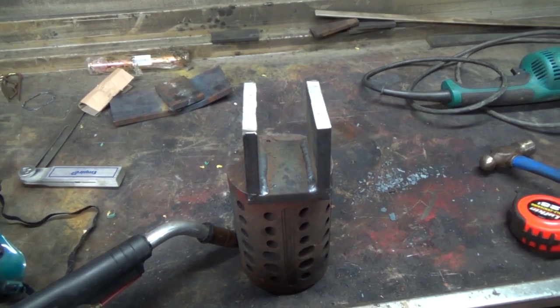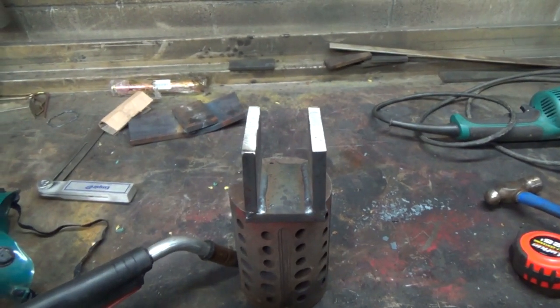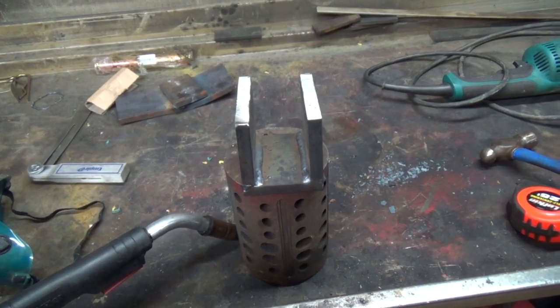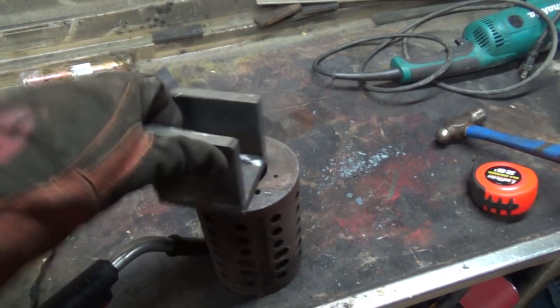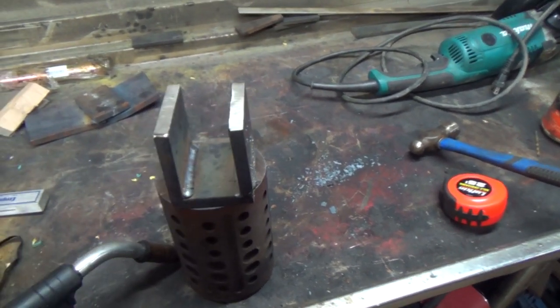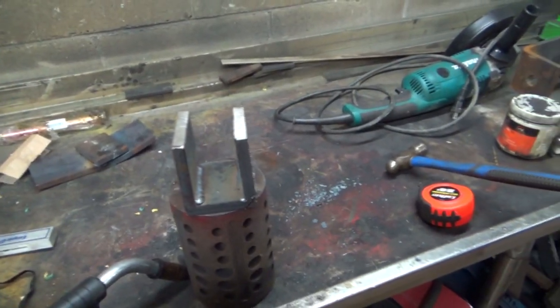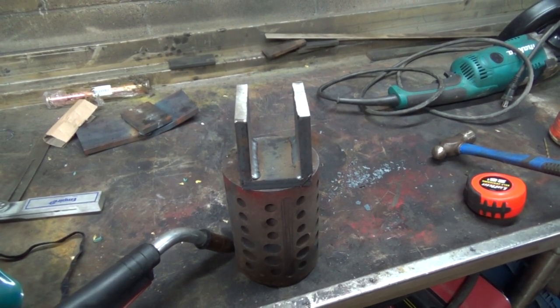It's likely not going to come back, but it should still work fine because I still got lots of room in here, so it should be alright. It's not bang perfect, but it should probably be alright. I was trying my hardest to not get her to do that, measuring it and giving it another little weld, measuring it again, giving another weld, straightening it, measuring it, straightening it, welding it again. There's lots of little spot welding, and I gave her a whole bunch here, but it never did come back. We'll see how she is tomorrow. That's about all I can do, I guess. We'll let her cool tonight, and then figure out where we want to drill her tomorrow.